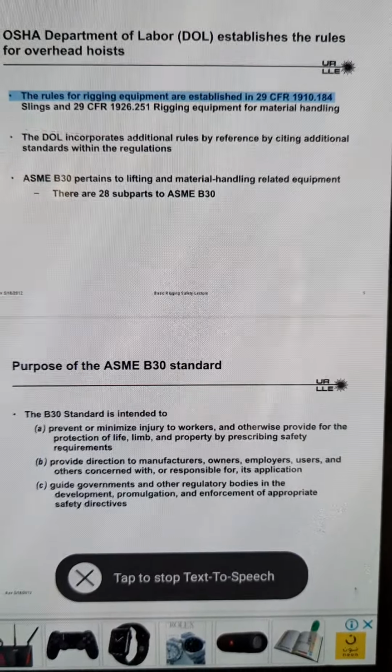Lecture 36. There are two styles of eye bolts: plain pattern and shoulder pattern. Straight vertical lifts only for plain pattern; angular lifts up to 45 degrees from vertical for shoulder pattern. Lecture 37. Machinery eye bolts must be used with great care.